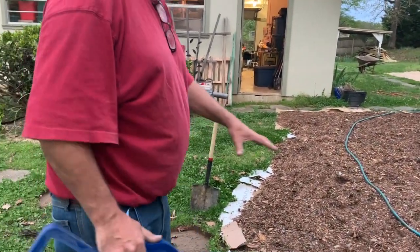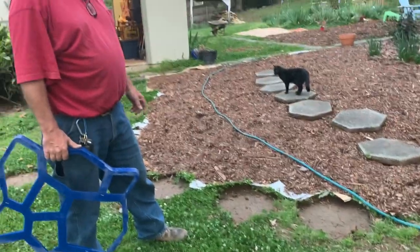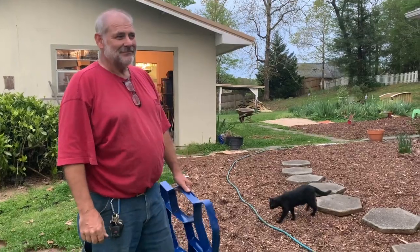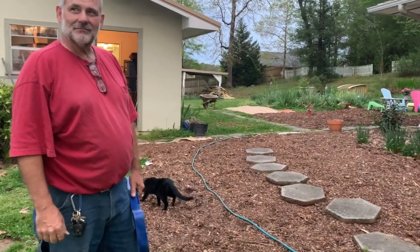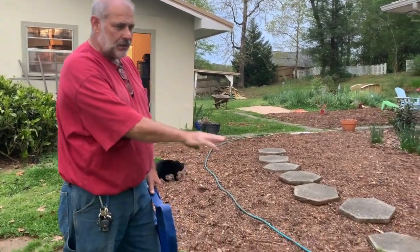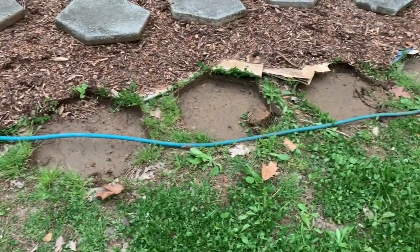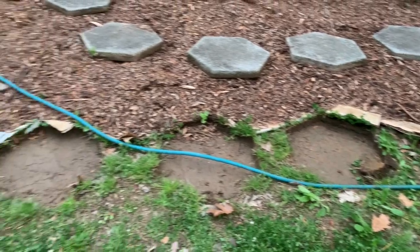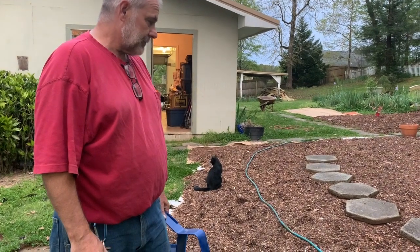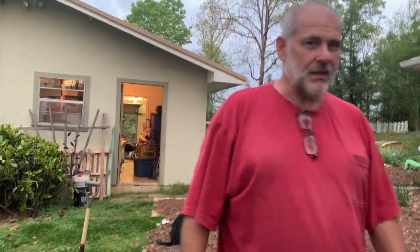We're gonna pack in, I've got a good pile of dirt over there on the other side of the carport that we're going to put in here and pack down where it was dipped down. We're gonna take a weed eater and knock that down really flat, so when we pour the concrete, it's gonna be a nice and flat surface, which we'll show you tomorrow. We'll do an actual video of us doing that, and so yeah, I'm gonna keep working. Okay. Hopefully I said everything that I said.